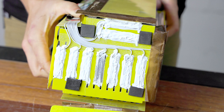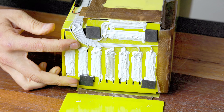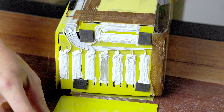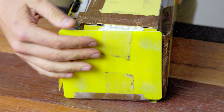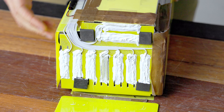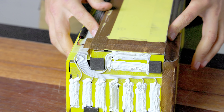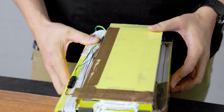You can see all the connections of the balance wires — they're all glued on here as well. And you can see these feet sitting down here, which help hold the bottom of the battery off the pack. This makes sure nothing touches when the battery is put down into the pack during potting. There are purposeful gaps all over here to help the potting compound get into all those cracks and fill that up.